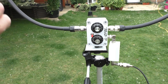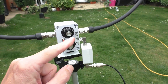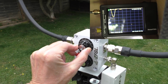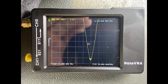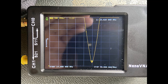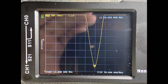What I'll do now is put the camera up to the VNA and then tune this anti-clockwise, and you'll see the little peak on the meter travel across as we head down towards 20 and 40 meters. Looking at the still shot I've taken: the low peak of the SWR — at its lowest point — was almost 1:1, at 1.13. However, that was on 24 megahertz, or 12 meters. What we want is for this antenna to tune from high 26 megahertz up to high 27 megahertz, perhaps just into the 28 megahertz 10-meter band.